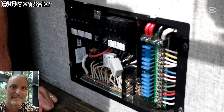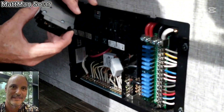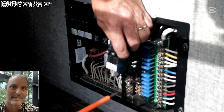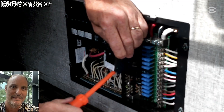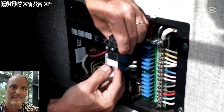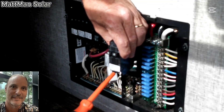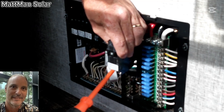I'm going to pull these wires out so I can reconnect them to the new breaker. The new breaker is a 1515 — that's the old one, this is the new one. We're going to put the wire in the first side and tighten it down. These are double breakers, which basically means they feed two circuits off a single breaker. It makes it convenient to get a few extra circuits, though you can sometimes pull more power than the panel can support. In my case I have a 6000 XP, so I've got 3000 watts per leg.